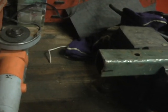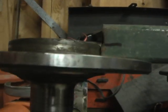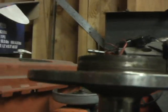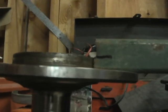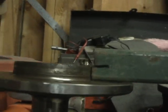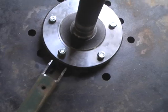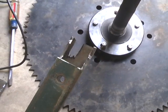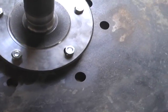What I'm going to do now is notch out my square tubing so it fits underneath the lip of my axle shaft. I'm going to use this cutoff tool to do that. There's a big lip on the shaft up against my hub, and this way it will firmly lock inside so it will put more strain on the center of the axis. I finished notching out these pieces of square tubing. I had to put an extra notch in this one because the bolt going to the axle shaft is in the way.